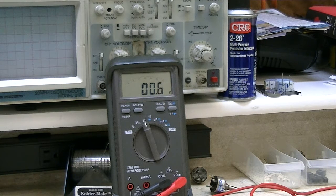The first one I have connected up is the exact same series style and resistance of potentiometer. It's actually a little bit noisy but more or less good, and I'll show you how it reacts. It's a logarithmic taper, so the resistance — it's a 500K — goes up pretty quickly at first with a very small rotation.